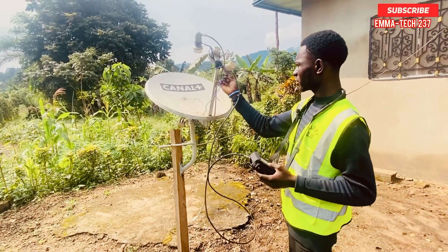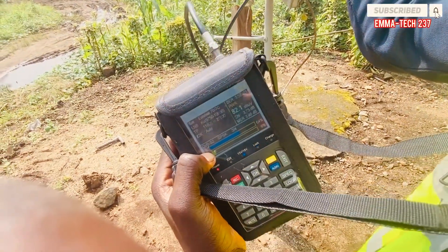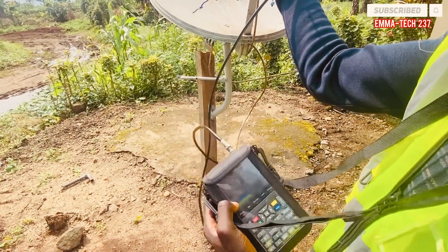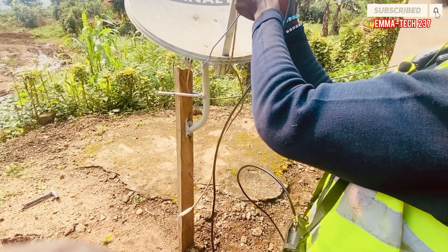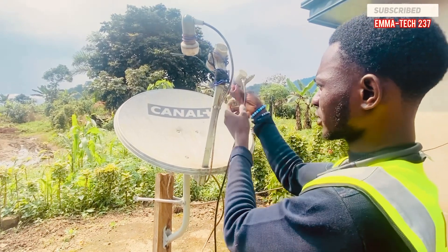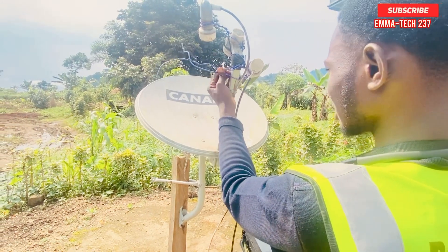Your LNB is going to come down because the primary is at 16 degrees, so the LNB needs to be somewhere down here — come and take a view. I haven't positioned the LNB yet, so since I know where it falls, I'll just tie it. Let me cross it like this and tie it here, and align it using my satellite finder.